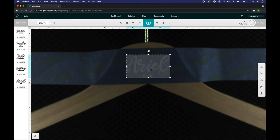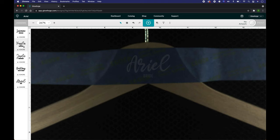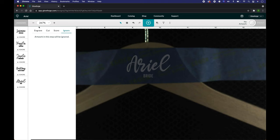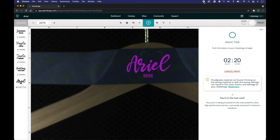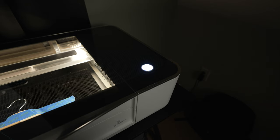And I got everything uploaded. I have all of the names uploaded, but I got everything on ignore. So I'm gonna go over here to the first design, which is right here. And I'm gonna go over here to engrave. And we're gonna go over here to manual. And I'm just gonna use the speed of 1000, full power, lines per inch, 225, and auto. So it's gonna take each of these designs about 2 minutes and 20 seconds.